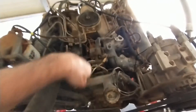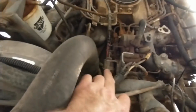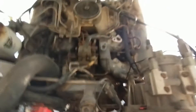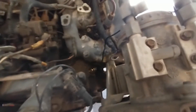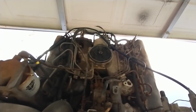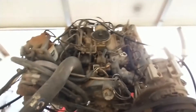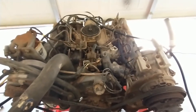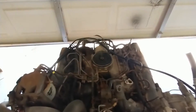There's also an idle-up solenoid that gets power when the engine is cold — there's a temperature sensor in line to both of those somewhere. The water temperature gauge is a mechanical gauge and I'm okay with that, but I don't like mechanical oil pressure gauges with the thin neoprene hose. I've had some of those blow off in the past and make a royal mess, so I'll put an electric gauge in that hole eventually.